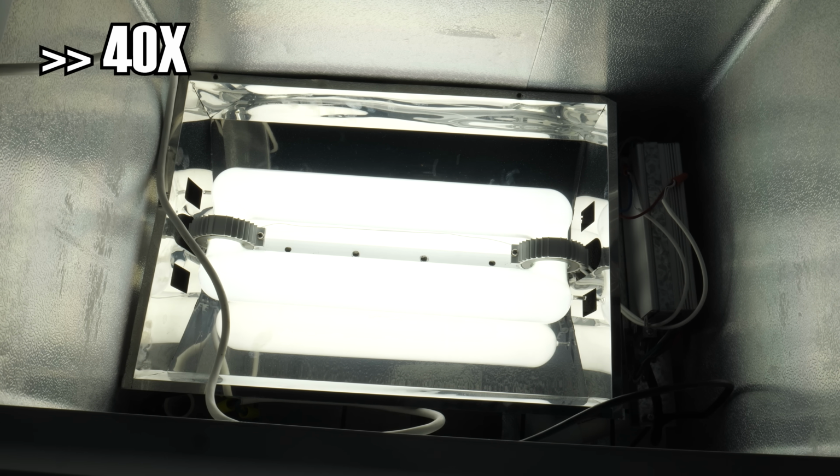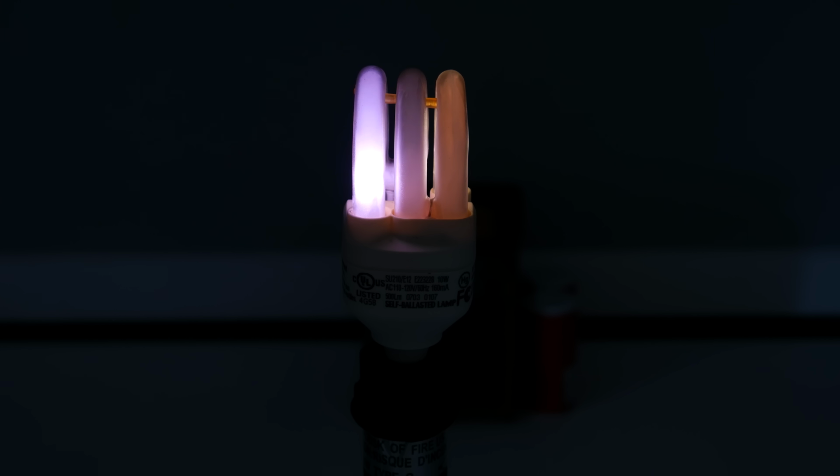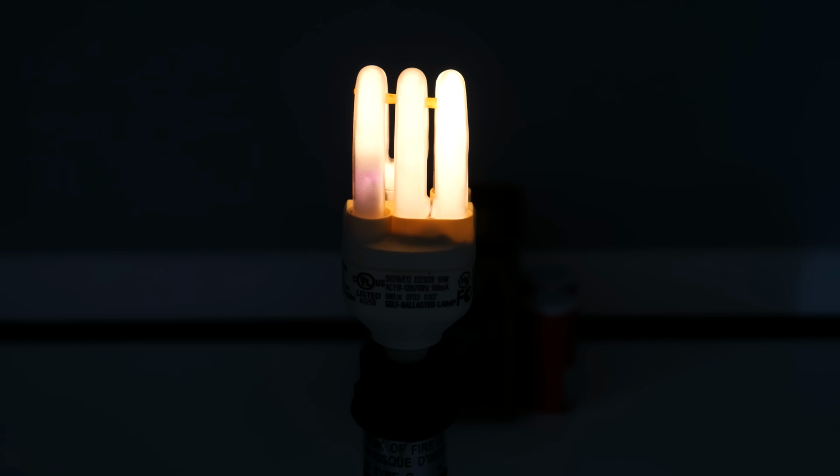Speaking of starting, well, now it's time to come clean here. I don't really understand the mechanisms by which these lamps start. See, the gas mixture in these tubes isn't electrically conductive until it's ionized. The electrodes in a traditional fluorescent tube emit electrons when heated and/or when a sufficiently high voltage is placed across them, and those electrons will collide with the gas molecules inside and ionize them, which causes dielectric breakdown. But with these, all we got is magnets.